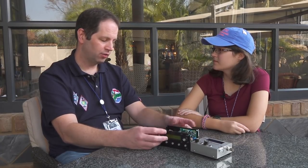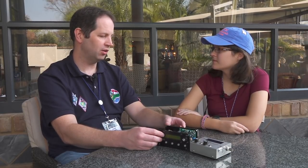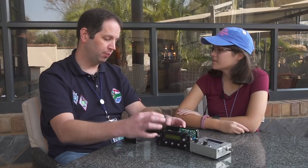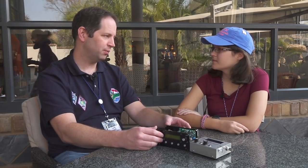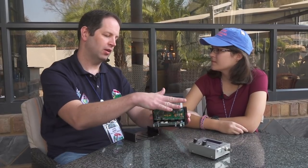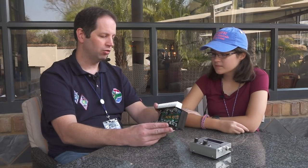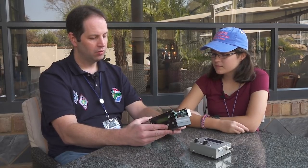I'm using a 24-bit analog-to-digital converter chip with a really high dynamic range, and a 24-bit digital-to-analog converter chip on the output from the SDR. There's a big heat sink on the back, so with things like FT8 which are continuous duty cycle modes, it shouldn't overheat. For somebody who puts in the effort and reads the instructions carefully, it'll be really well worth it — producing a really high performance radio at low cost.